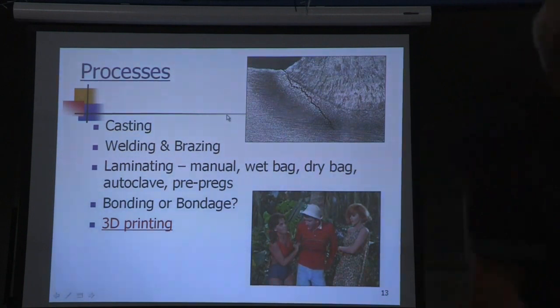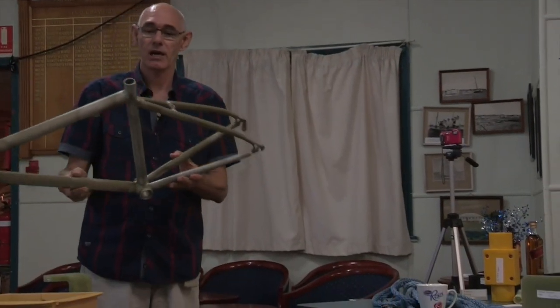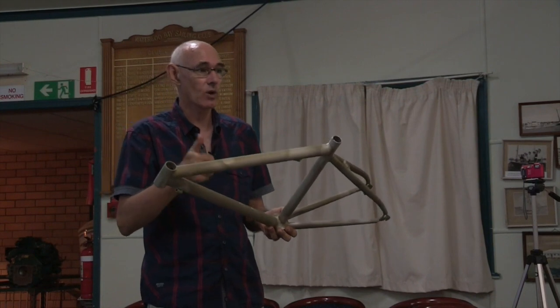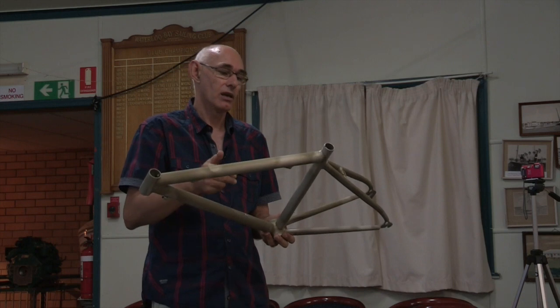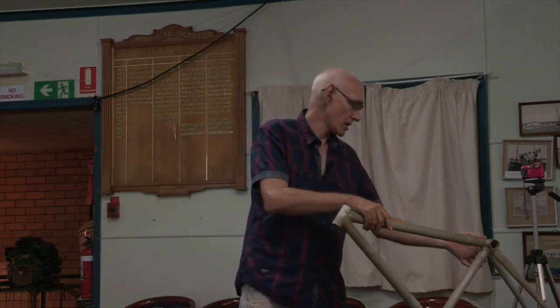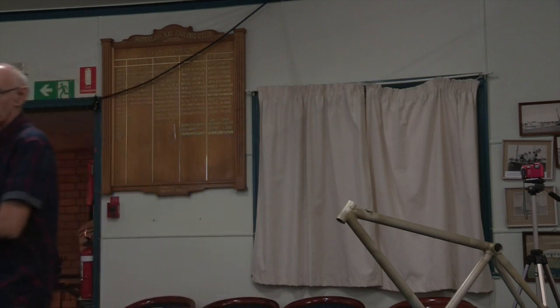Twenty years ago I used to make bike frames like this one, and we had to sell frames into Europe, and we had to pass an endurance test. Our brazed steel frames passed the test, our welded steel frames failed, our aluminium welded frames passed, and our aluminium welds dressed, which is this one, mechanically dressed, did really well. That's because when you dress a weld, you remove that beginning crack at the toe.